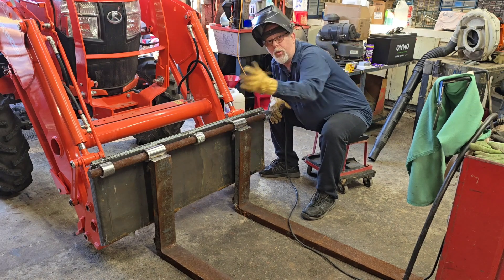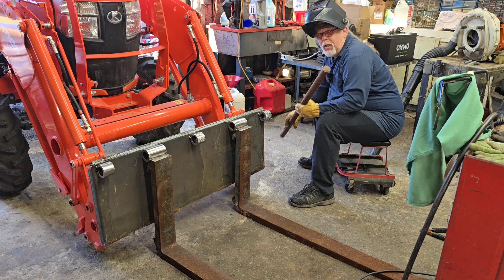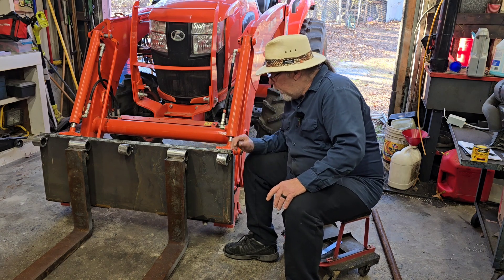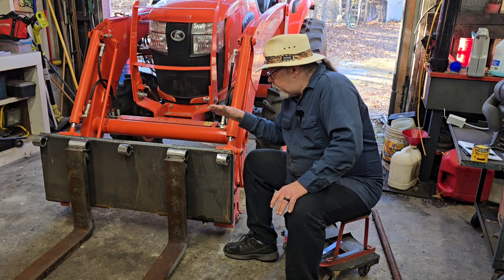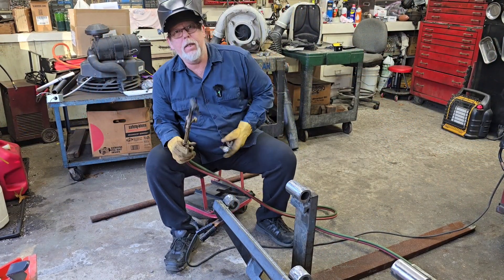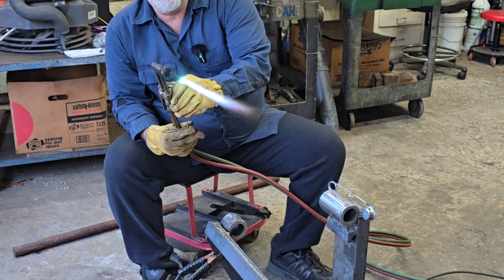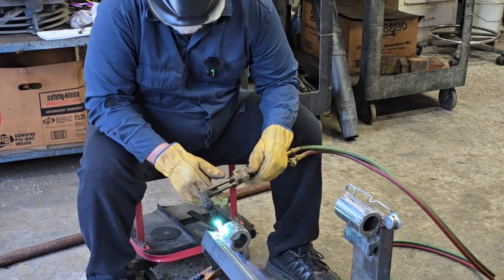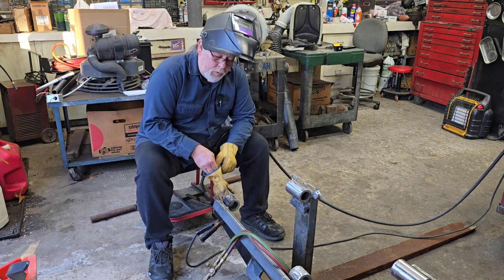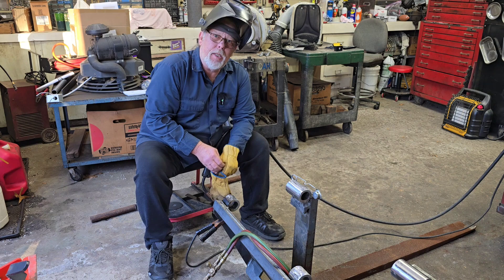I did put a little tack under the bottom on all three — that way it don't start to curl when you weld one side. Let's get it back apart now. There's a couple of reasons I wanted to take it back apart. I'm going to take this plate back off the tractor. I could disconnect the battery, but there's an awful lot of expensive electronics in this tractor. So I'm going to take this plate off, prop it up, and weld it on the floor — not on the tractor. We're going to heat this bad boy up before we start welding.